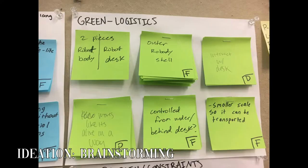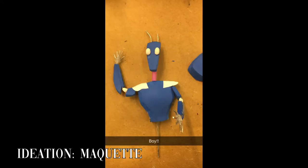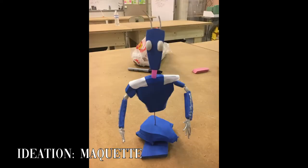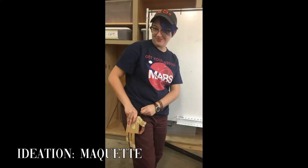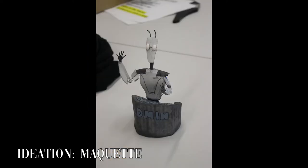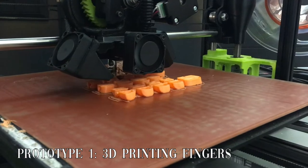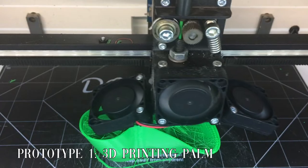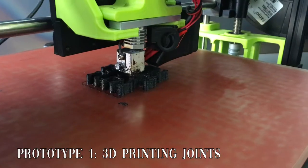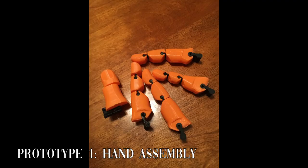Our first step after the pitch was to combine all of our ideas together and visualize what we wanted the project to be. We then mocked up a miniature maquette of our effect using wire and foam and saw the admin bot in the physical world for the first time. Our first prototype utilized the 3D printers in the foundry to create a working hand from a model we had found on Thingiverse made by Dryrobot. The hand was able to move thanks to the joints being printed in NinjaFlex and the fingers each being pulled down by their own string.